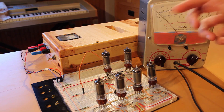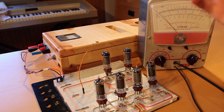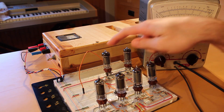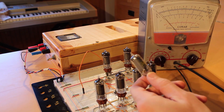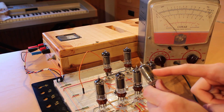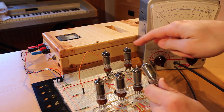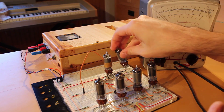But there is a fundamental flaw — I just don't have all that many of them, only about six or so. That would be fine for the little proof of concept, but for the larger version — the full replica of the MC14500 — I just don't have enough. Searching on eBay, they're not very cheap and not nearly as common as the 6AU6. So I want to take a look at using a different tube. This looks to be the best candidate — the 12BA6. It's still a sharp-cutoff pentode with a 12-volt heater, so it could be a good alternative. Let's swap in the 12BA6s and take some measurements.